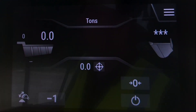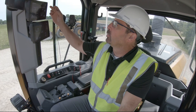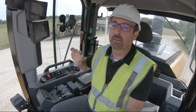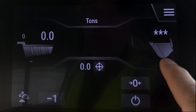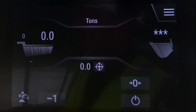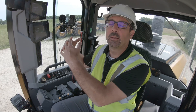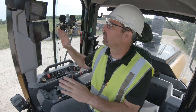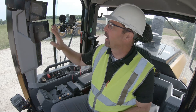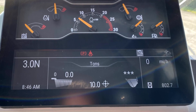There's a high definition display right here below the main display, so you've got a dedicated display for payload, and you do not have to access this through the main menu any longer — you've got your own access through the payload system right here. You've got your bucket information on the right-hand side, your cumulative weight and your passes, your bucket zero cal button, your standby button, and then you subtract off the last pass or zero out your truck button. If you want a very basic, easy-to-read display, you've got your payload information here on this front monitor as well.